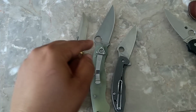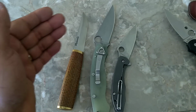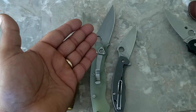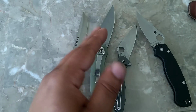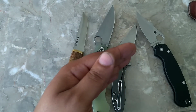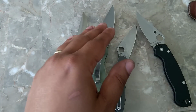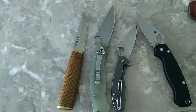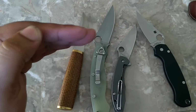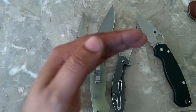And so M4 can have more of these carbides, but really they don't start to shine until you put an incredibly aggressive toothy edge on there. And what it does is it just means you'll have more edge endurance on M4 than you will CPM Cruwear. At the same time, that's not the ultimate end-all be-all, because when you have more of this carbide volume, it reduces the overall toughness, okay? It also means that you're probably going to lose some of that edge stability. It's not going to want to hold a super fine edge necessarily as long as something else.